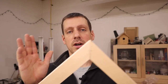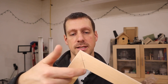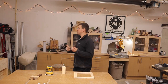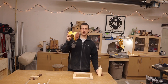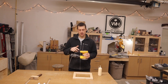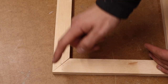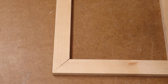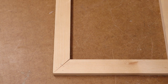Now that the glue has dried on this picture frame, we can go ahead and fix this joint that is tight at the top and gapped at the bottom. All you need is a bottle of wood glue and an orbital sander. If your sander has a vacuum on it, you're not going to want to use the vacuum because you want the sawdust that comes out the bottom. Honestly, if I had a joint that turned out like this on a real project I would just remake the whole frame — but let's say you're tight on material and need to get the project done. This is how you can fix it.